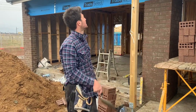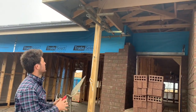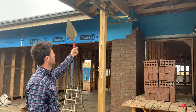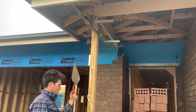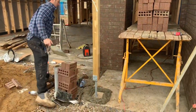I know this is pretty controversial with brickies — they say for a 470 rendered pier, just use your level. But what I like to do is set up brackets, or four arms, whatever you like to call them. Takes me two minutes. I'll put them straight up, one on each of the sides, going in alternate ways.